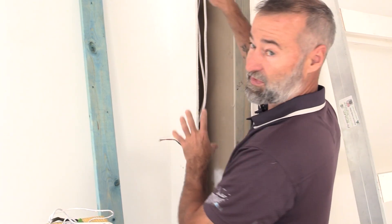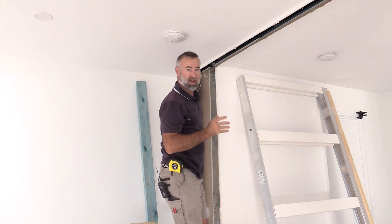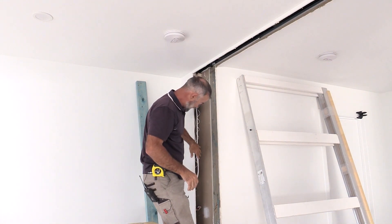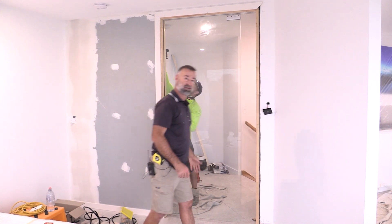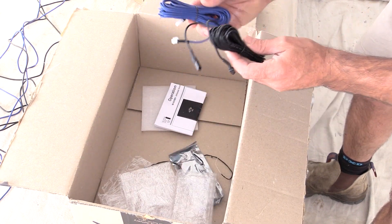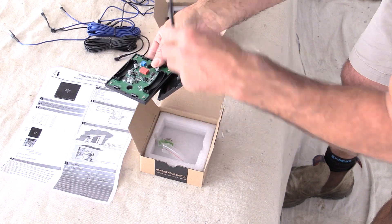I'm running the wiring through the wall now before we cover it up, so I can get the stud work in. The electrician won't have to worry about fishing it down through the wall later. I'll stick this up in the roof space - it's a lot easier to do while it's open rather than covering it up. In the box we have our little control sensors - that's what you wave your hand over to open the door. We've got two of those. We've also got the beam sensors that go into the frame, plus the wiring that runs down to those sensors. There's a little tail connector that connects in, and then this end connects onto our 12 volt wiring we just ran up into the roof.